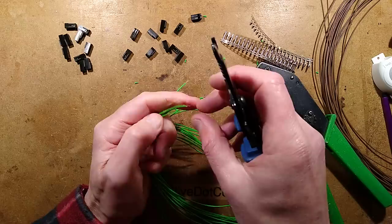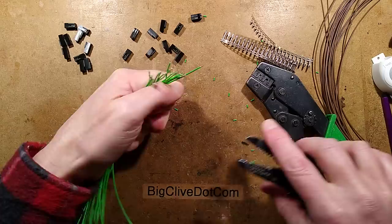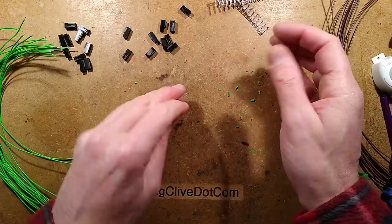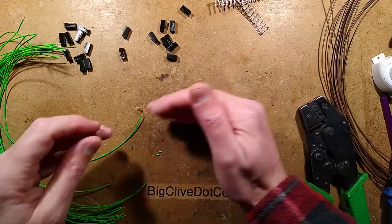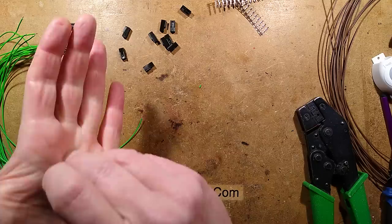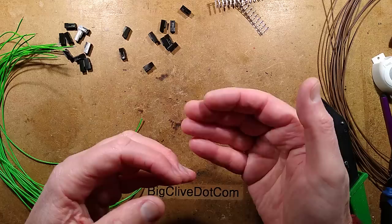Almost near the end of the first batch — there are 20 of these wiring arrangements being made, and for each one there's a green and a brown core. The reason for the green and brown is that these are the branches of a plant that will be dropping petals. It was an experiment for Beauty and the Beast that would actually drop the petals on cue. The approach I took was to attach the petals onto resistors plugged into connectors with a blob of wax, so that when you turn the power on, after a short time delay, it just gently flops down and drops. There's a video specifically about that.